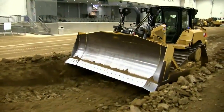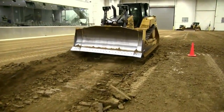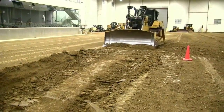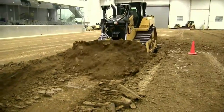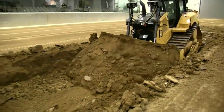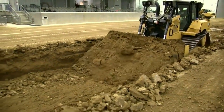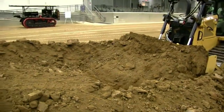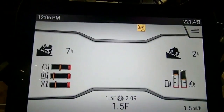When you're doing front-to-back, you always want to start where the end of your cut is, or where the toe of your spoil pile is going to be, and work your way backwards. You can see I cut going downhill, using the weight of the machine, using gravity. The big thing about this is you're keeping all that material in front of your blade. You're using the walls of your slot to hold that material in front of the blade. That way, whenever you carry it through the cut, you're not losing a bunch off to the sides. So that's another big efficiency gain here.